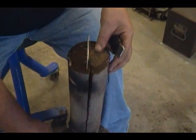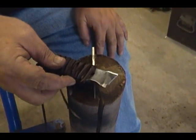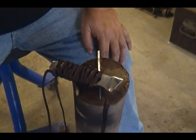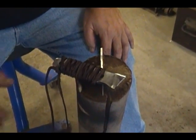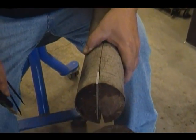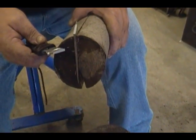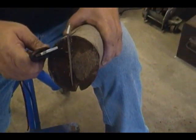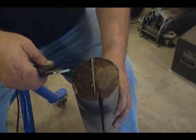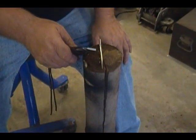That was my attempt, and you're going to see the fail. Right there it is. That's a heat treat failure. You can see the grain structure in the cross section. You can see a big frown on my face. I tried. I never tried to get this done this quick. I think where I failed is in the draw after the heat treat — left it too brittle.